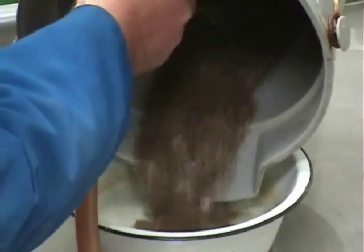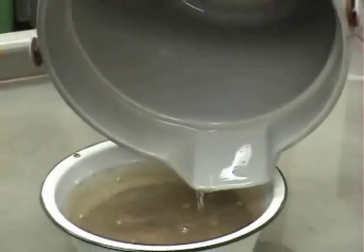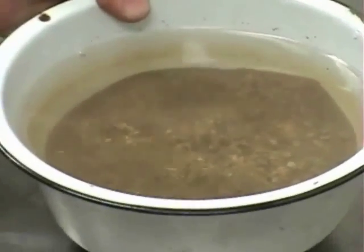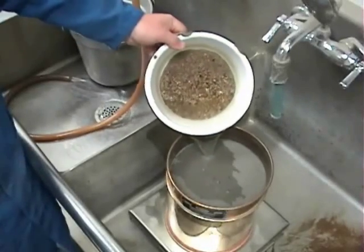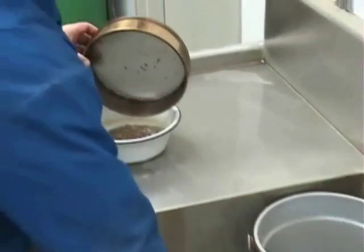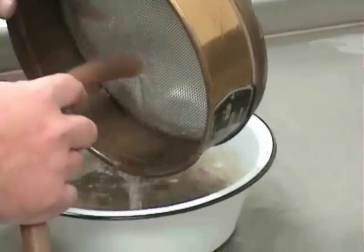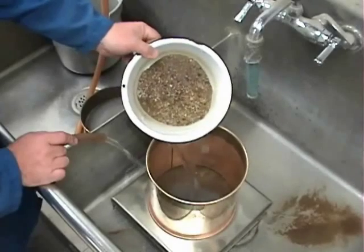The sixth step is to wash the material remaining in the bucket to the pan. Take care not to lose any material. Excess water on top of the sample needs to be decanted over the number 16 and wash sieves. Decant as much as possible without losing any portion of the sample. Thoroughly wash any material remaining on the number 16 sieve into the pan. Decant excess water over the wash sieve.